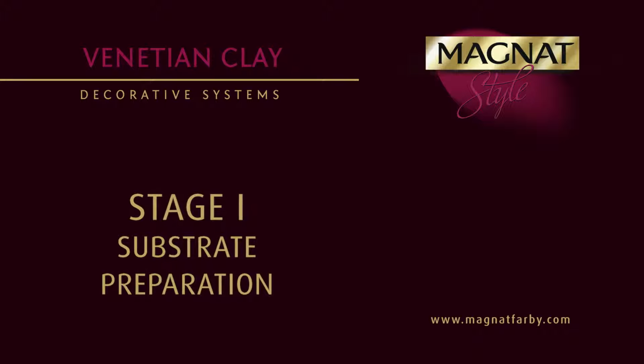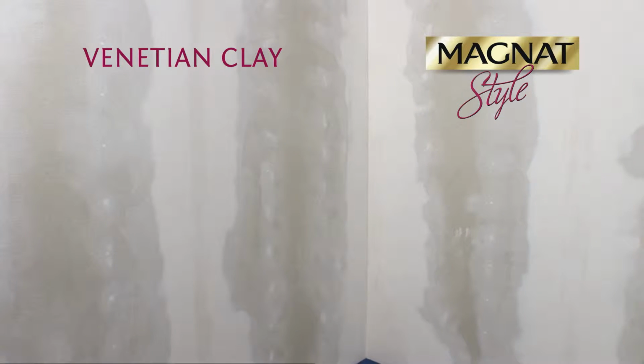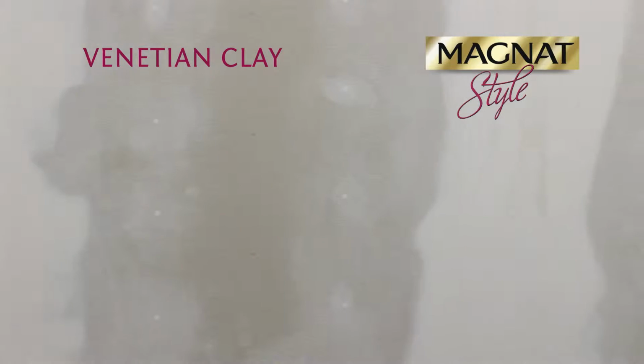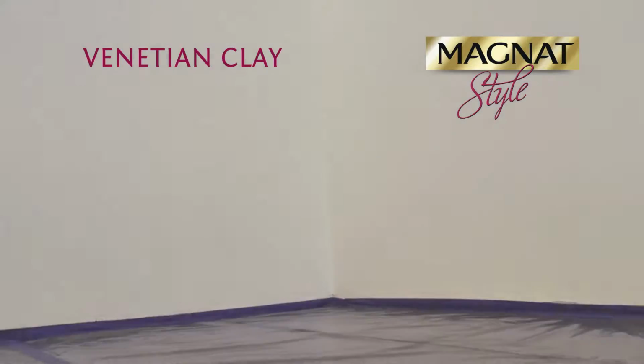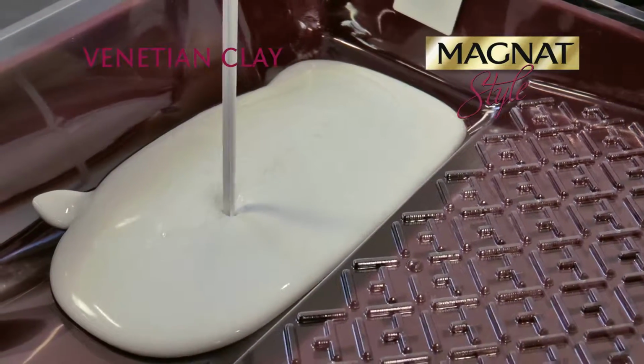Substrate preparation. Proper substrate preparation is a critical stage of work. The surface to be rendered with MAGNAT style Venetian clay should be solid, level, dry and free of dust, adhesive residues, oil, grease or grime. The substrate should also be smooth to produce a good decorative finish.